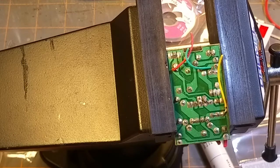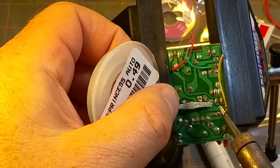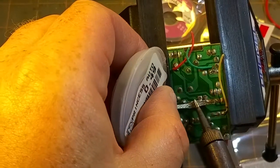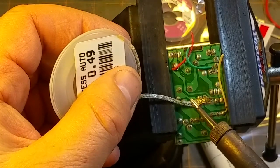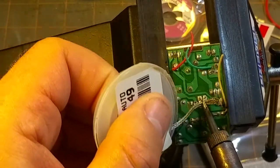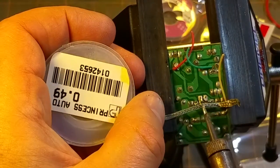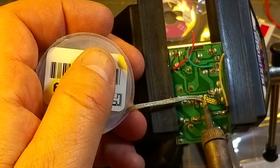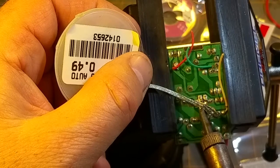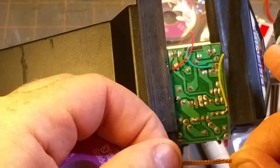Let's actually try this out. I'll grab a random board from my box of random boards. First we'll try the one I've had for a while — an 8-pin chip sitting right there. I'm not going to pull the chip right out; I just want to see how well this is picking up solder. It's taking quite a fair bit up. I don't usually use tons of wick if I can help it, especially for through-hole — I'll try and use a sucker. See it sizzling away and picking up a fair bit of solder.